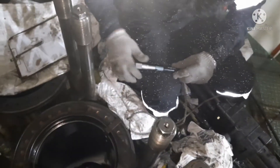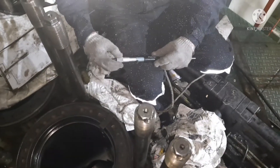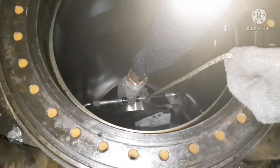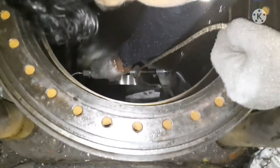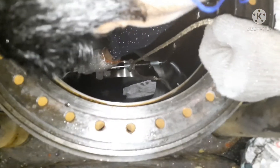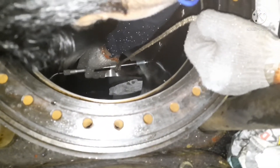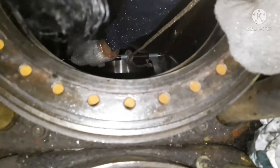Next I'm going for the last, which is the bottom end of the liner. Always set to zero — say if the bore is 290, set to 290 — and then you can easily work out the wear rate exactly. 290 plus whatever you are getting, that will be your reading.